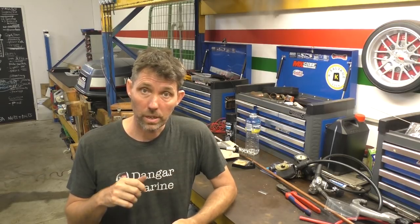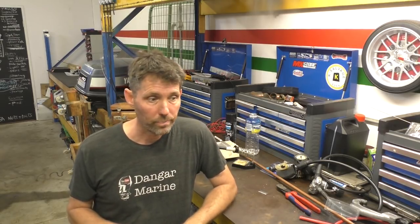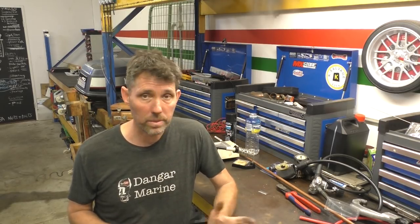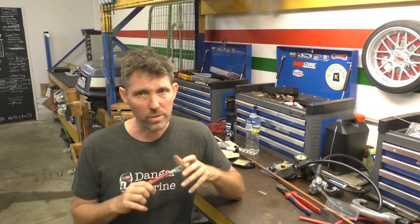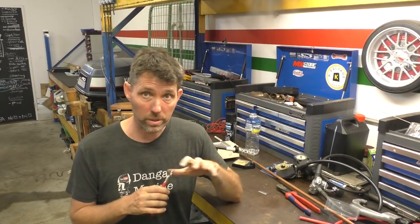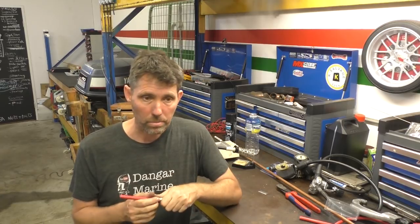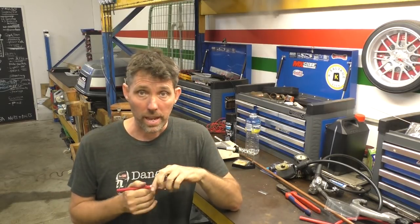The next thing I do is go through the original footage making the copper pipe lugs that Fireship or Jack suggested. I really like them for a couple of reasons: one is you don't have to use this method if you'd rather buy a commercial set for five dollars. But it's quite clever, it could get you out of trouble if you have some pipe lying around. My understanding is that these copper ones are filled with solder as opposed to crimped, and then the entire lug is dipped into a pot of molten solder to tin it — because the bare copper will get an oxide layer that adds resistance and degrades over time.